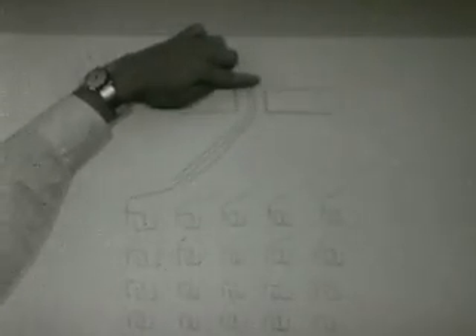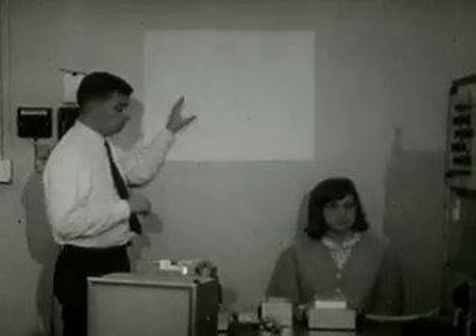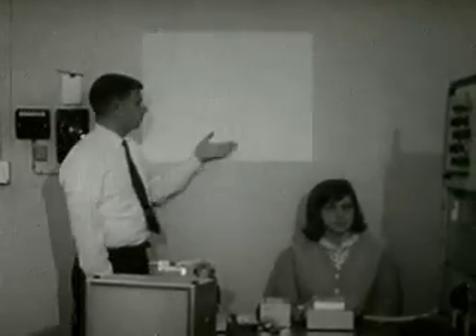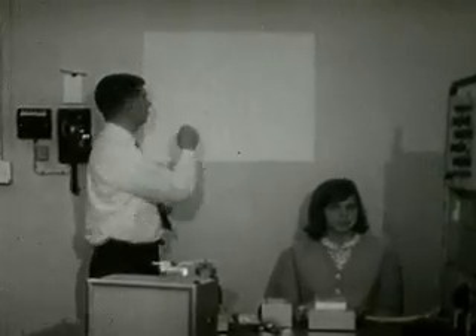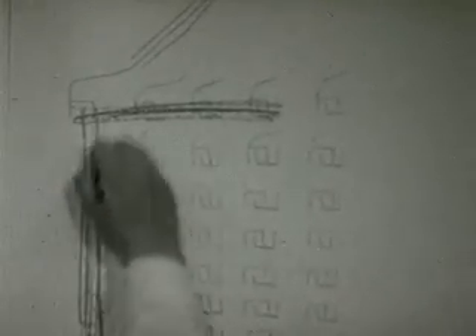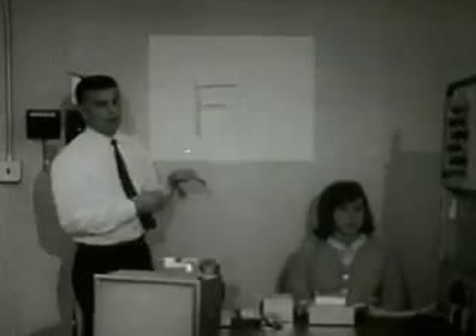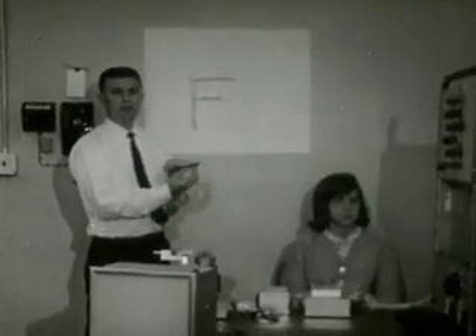If a person puts his finger on the sensing plate, he will be able to feel the reed being lowered and raised. To consider a practical application, let's visualize an array of photocells on a plate such that a blind person could move this plate across a printed page. An optical system would focus the letters of the alphabet onto these photocells. If each photocell is connected to a corresponding reed, as the letters are imaged onto the photocells, each photocell that sees a portion of the letter will activate the corresponding reed. Thus, tactile images of the letters will be formed which can be sensed by the fingers.